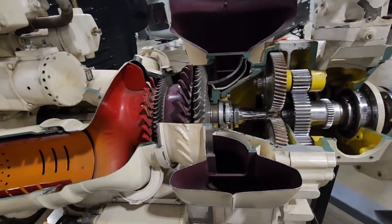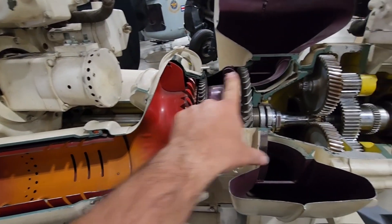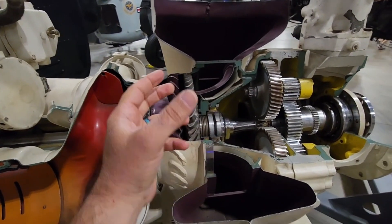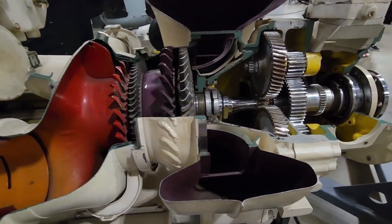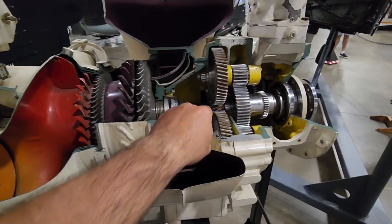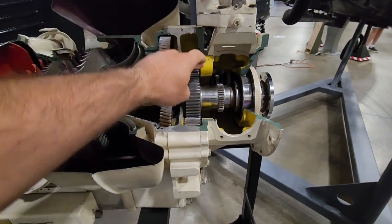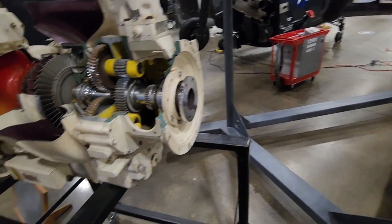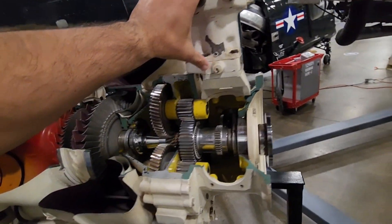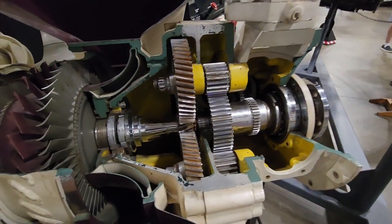This engine isn't as efficient as what we do nowadays, where you might have two N2 turbines and three stages in a row, because you're just trying to milk every last piece of energy out of the velocity coming out. The N2 turbine spins the sun-and-planetary gearbox, and there's your output that goes to your propeller governor or other equipment. Some of these accessories might be a governor.